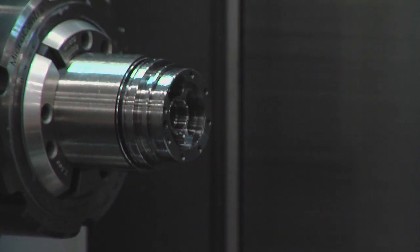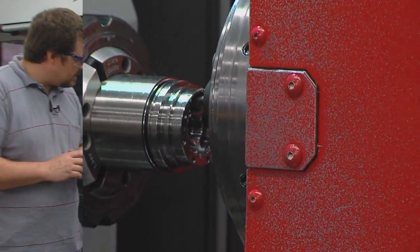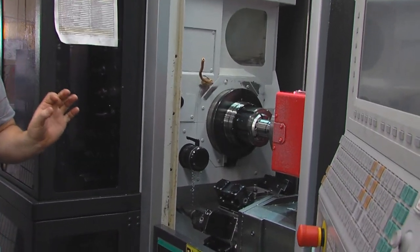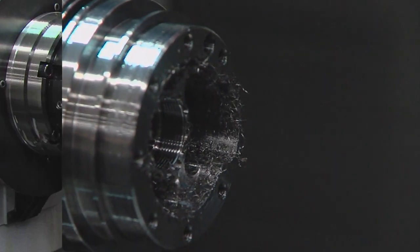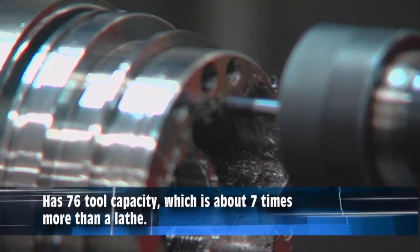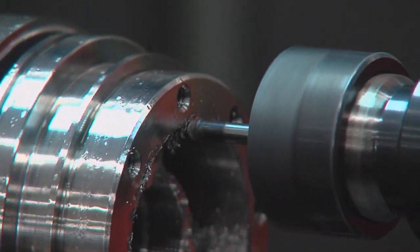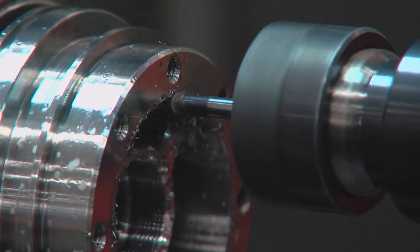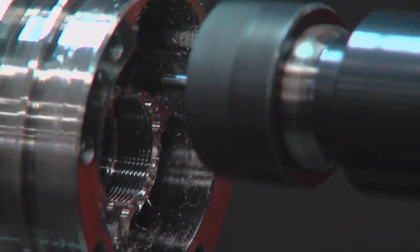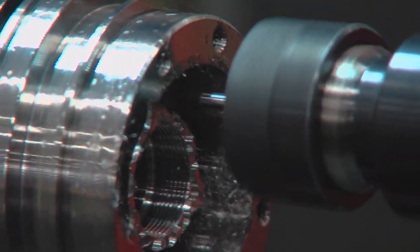This is the finish work for the inside of the part — that's all roughed out now and we move right along. It's probably hard to see on camera, but there are tiny chips being removed — it almost looks like powder coming out. What we're doing here is part of the deburring we talked about: going around the outside profile with a 45-degree angle tool, removing all the burrs and putting a nice chamfer on everything. There's no way you can accomplish this by hand and have it look as good — you can't achieve the continuity: all parts look the same, all machined the same. In this business, a part that looks different from another is a huge red flag.